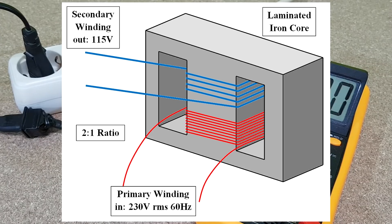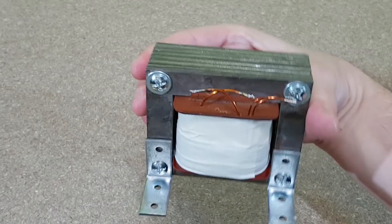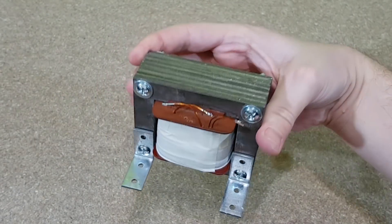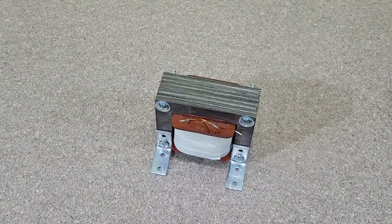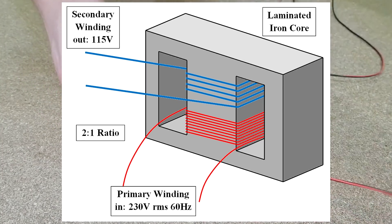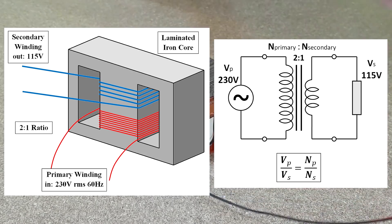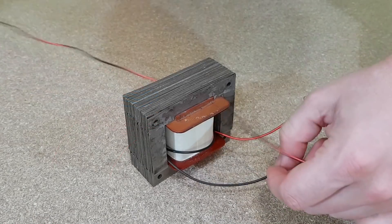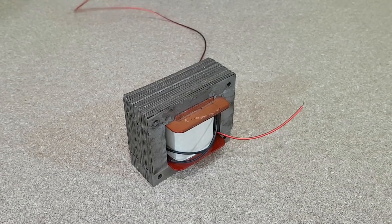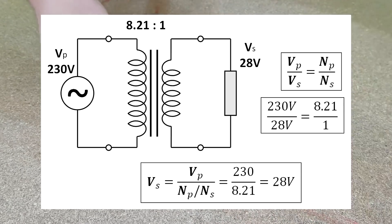The magnetic flux will induce an electrical current into the secondary winding, which is wrapped around the same iron core, so you will have an output voltage separated from the mains voltage. A transformer is used to step up, step down, or keep the same voltage and insulate the input from the output. This is a step down transformer, because the number of turns in the primary winding is bigger than the number of turns in the secondary. It has a turns ratio of 2 to 1, because the primary winding has twice the number of turns than the secondary.